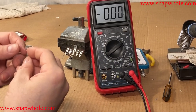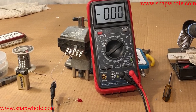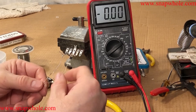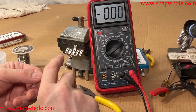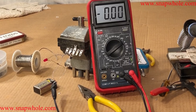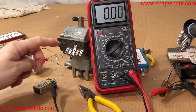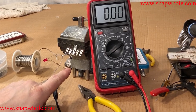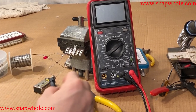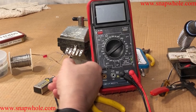I also want to use an LED to indicate if the power is on or off, and I want it to be remote from this so I can mount it in a box. So I'm just going to take two wires and extend it. I've already soldered the resistor to the LED and that goes to ground — the resistor is to limit the current. That's lit. I've got that on the 12 volt side and I used a 500 ohm resistor. So we have input, we have output, and we have something to tell us if it's on.